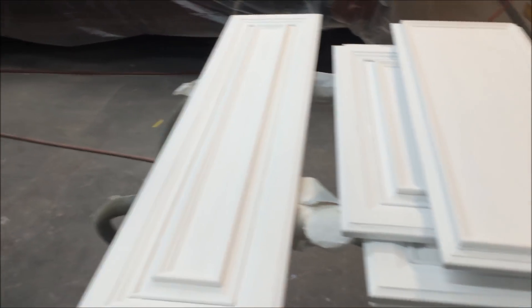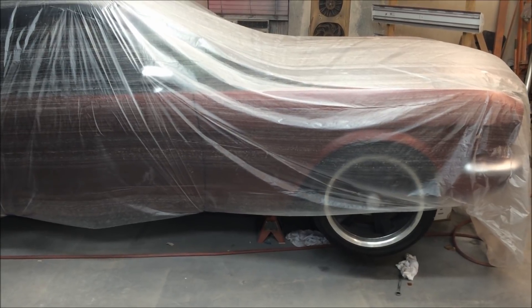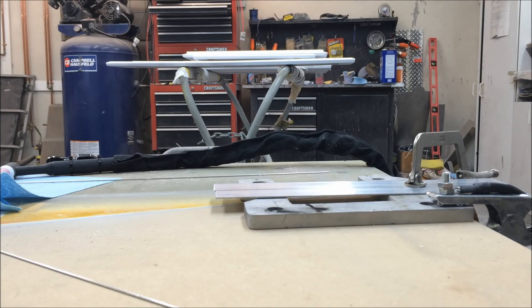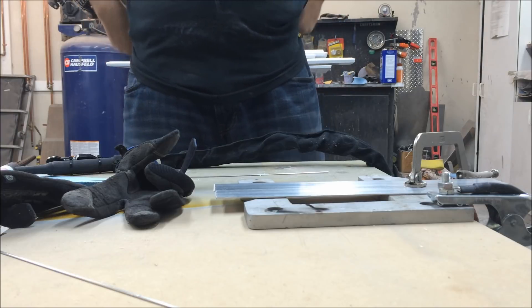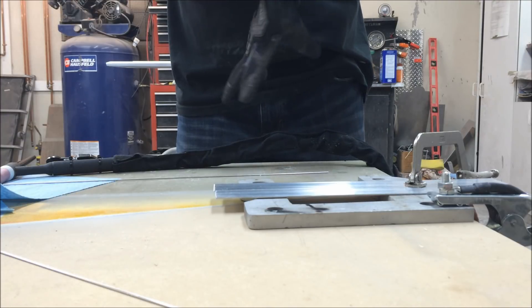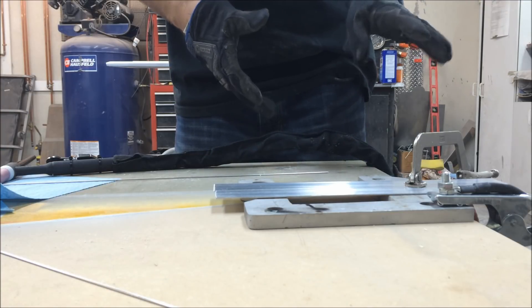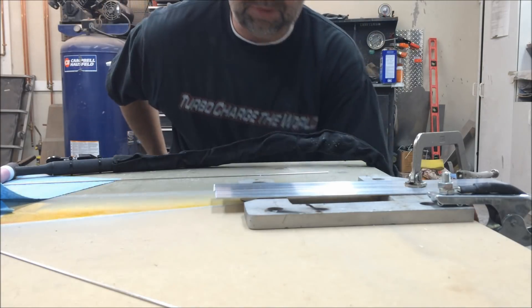We're going to do a quick video showing the TIG welding and keep you updated when we get ready to fix this thing. I've got some sixteenth-inch aluminum and I've mostly been practicing with that since that's what I'll have to weld. I also practiced on an old cast bracket — very dirty. Make sure you have professional welding gloves, not mechanic gloves with holes, and wear arm protection.